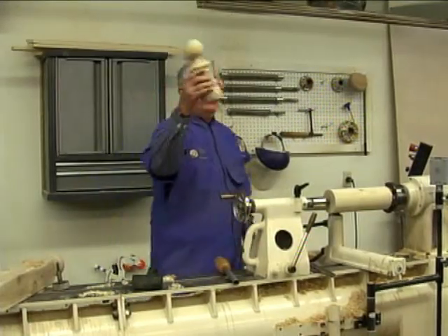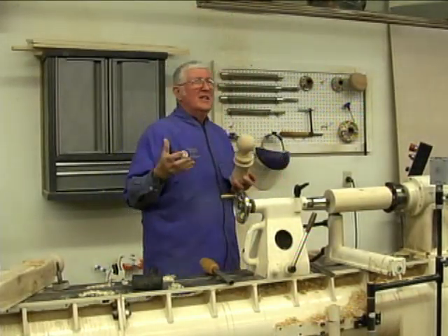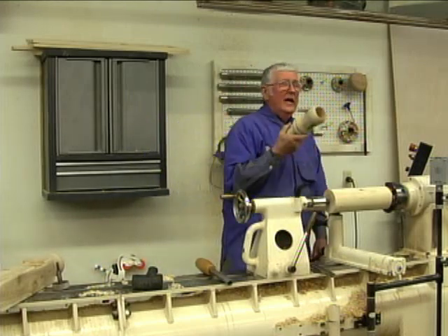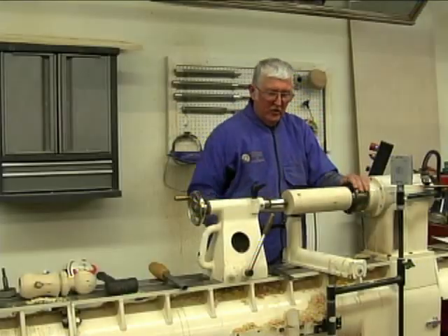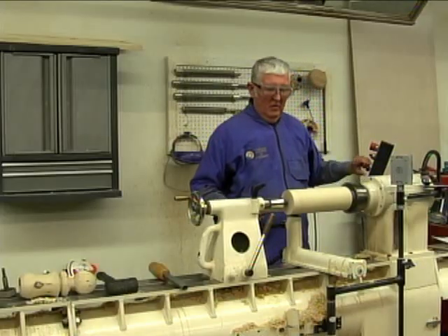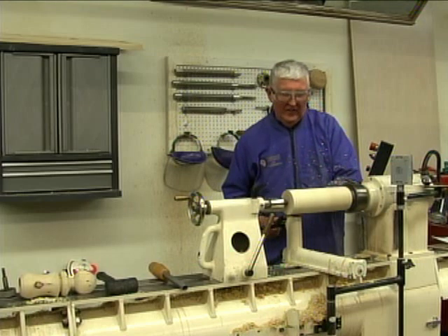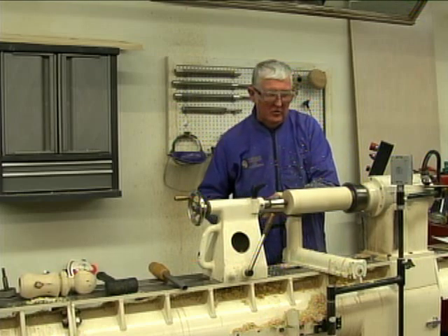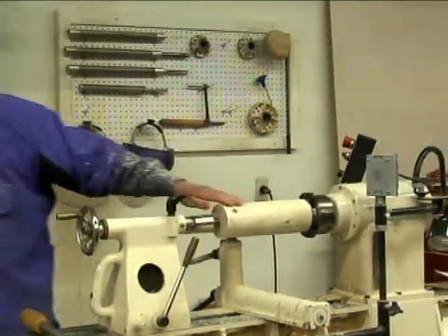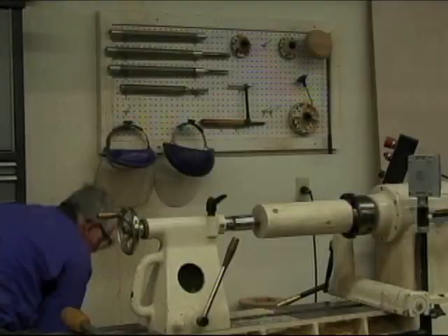What I'm going to be doing is another top piece. You might think, well gee, that's kind of redundant because Tom just did a lot of that stuff. Well, he didn't do this. Between centers I'm going to screw it up, get it nice and round and smooth. I want this hand to be nice and smooth — this is where the rollers of my steady rest are going to run, and I want it to run rather nicely, so in comes the steady rest.